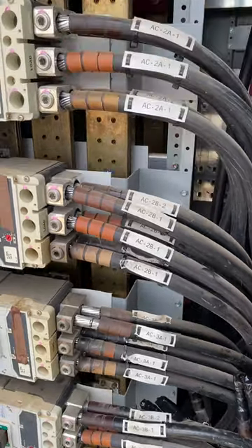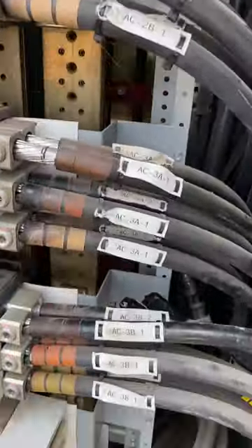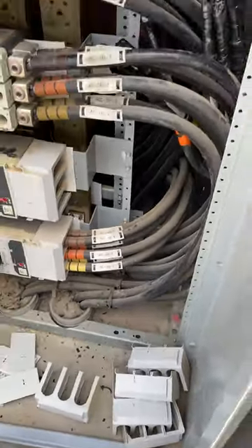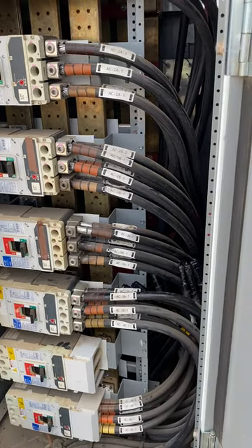But some are still shiny, and we're checking the torque on them like this one. We've got these top three, and this third one from the bottom looks okay, and probably the bottom one. So we've got three of these IDP sub-panel breakers that are overheating, and we found loose lugs.